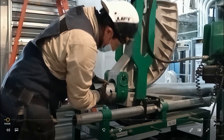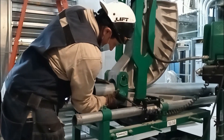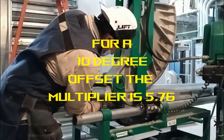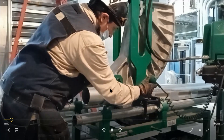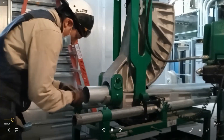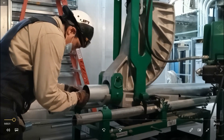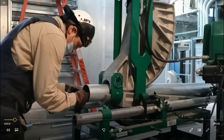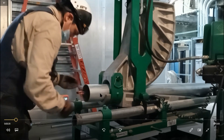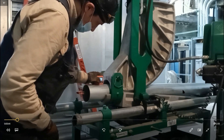After you're done laying out your conduit with the spacing you need, you place your pipe inside the bender like so and you want to lock it up or snug it up. Making sure that this is level — this bender was a little messed up so sometimes the hydraulic pump releases it — but you want to make sure that you level it out and lock it up, then place your level on there.